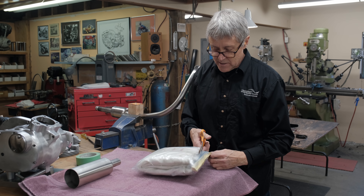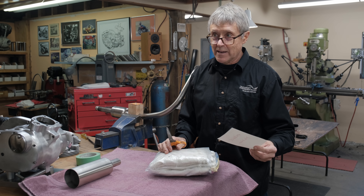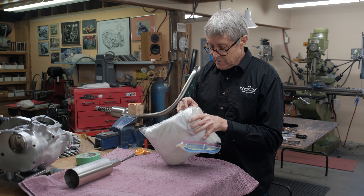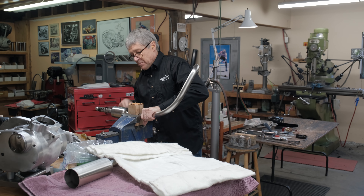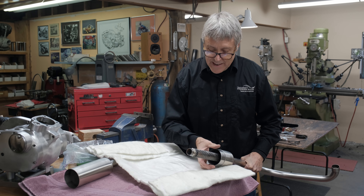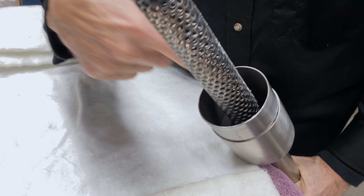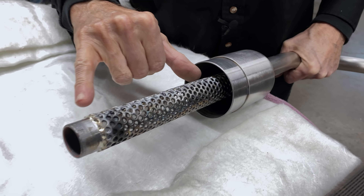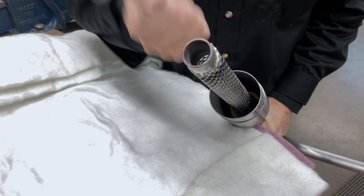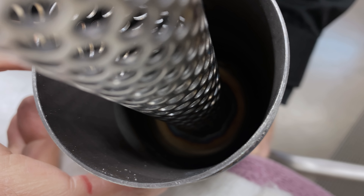One of the things I've been thinking about is that everybody tells me you've got to pack it tight — no one ever complains you packed my exhaust too tight, I've never heard that. So we're going to see what we can do here. If I wrap it around this pipe, it's got little bumps here on the seam and I can't slide it down there. So if I want to pack this really tight, I can't get it all the way down. What I've been thinking is I'm going to cut a strip that gets wound, and then down here I'll take some small bits and pack them with a wooden dowel as much as I can. That's my plan.